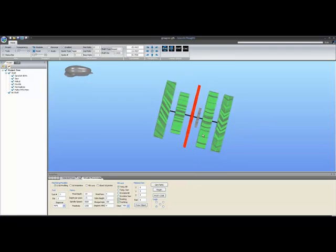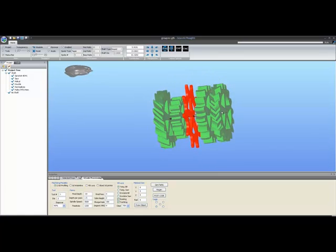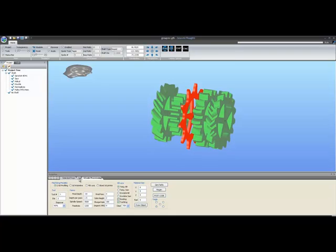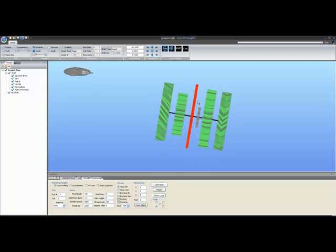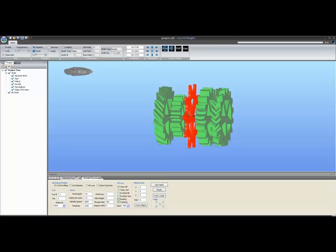The screen, you'll notice, is still showing me my 6 objects, and this is because I have not yet selected anything to be machined. A message passed by on the screen saying select object when I press CNC. You may not have seen it. System messages last for about 4 or 5 seconds and roll off of the screen so that they're not constantly bothering you. So at this point the system is waiting for me to click on an item.